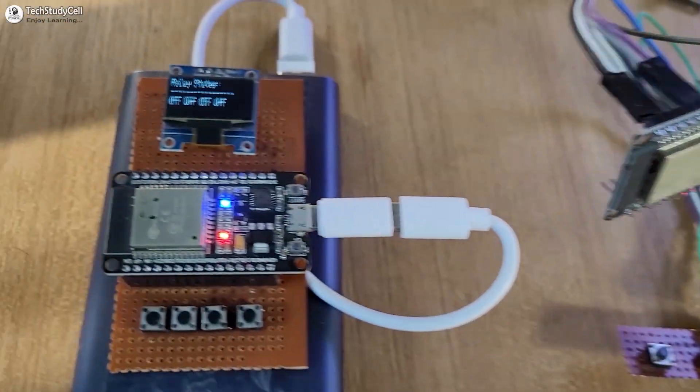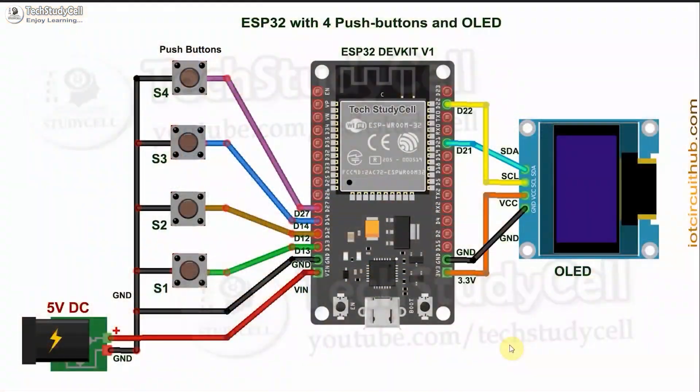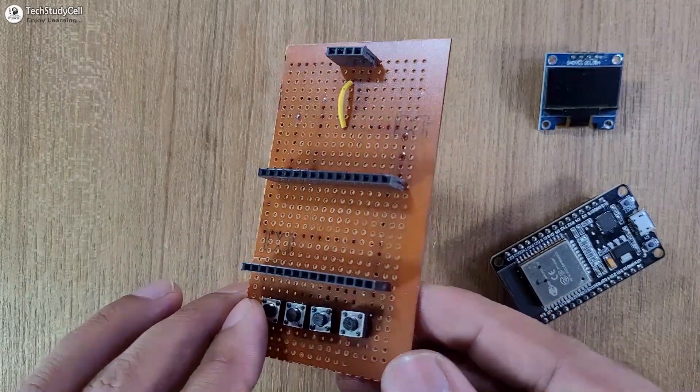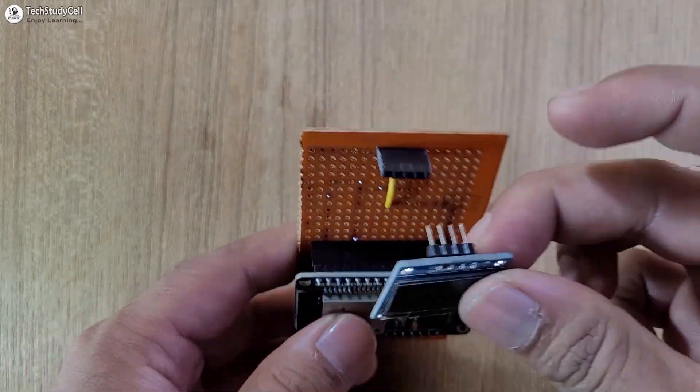To make this project, you just need two ESP32s, a four-channel relay module, some push buttons, and an OLED to monitor the display. This is the circuit for the master ESP32 — I have connected four push buttons across the GPIO pins and ground, and also connected this OLED to display the feedback from the slave ESP32. This is the circuit for the slave ESP32 — four push buttons across the GPIO pins and ground to control the four relays manually. I have used an active low relay module, so the circuit is very simple. To avoid loose connections, I have made the complete master circuit on zero PCB.